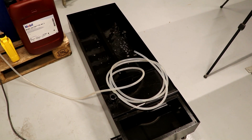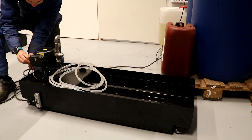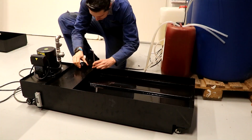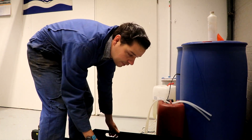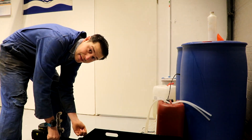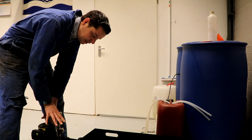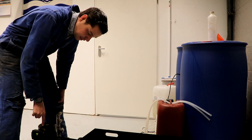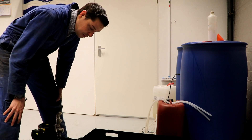I'm gonna check the coolant level, install the pump back, and then see if we can get it running. So here's your first filter, and then you have one here, and one here, and then there's still a filter at the pump. I think that's really good of them because then you have a lot of filtering before the chips actually reach your coolant pump. So I fill it up, put some Blaser in it, mix it up.